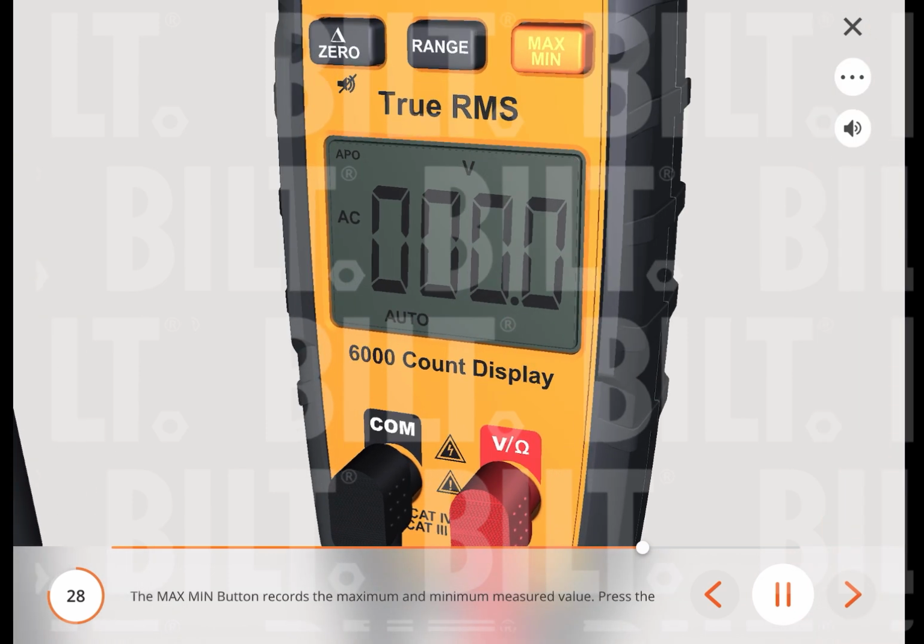The max-min button records the maximum and minimum measured value. Press the max-min button to activate this feature and to toggle between max and minimum readings. The unit will continually capture max and min values over time. Depressing the max-min button for over 2 seconds exits the max-min mode. If the meter is turned off, all max-min data will be lost. Note: when the max-min function is activated, the Auto Power Off (APO) feature will be disabled. When you exit the max-min function, the Auto Power Off feature is enabled.